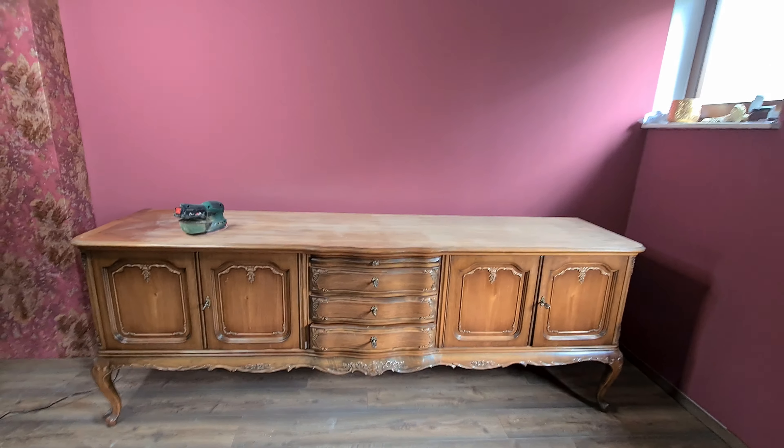Because the top of this furniture was quite scratched, I decided to sand it to the bare wood. I took away all the varnish that was originally on this furniture, and after I sanded it and dusted all the dust away, I applied three or four coats of clear coat on this bare wood — on the sanded top.